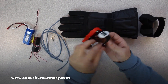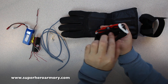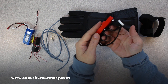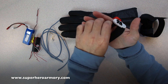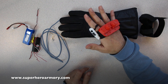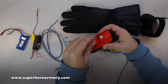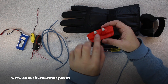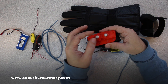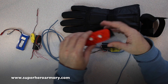Here's the hand module. I attached this webbing here and thinner webbing for the fingers. The way this goes on — this one goes over that finger — and then the thumb is used to hit the trigger switch. In the electrode assembly, I'm using nylon screws so I won't have any kind of conduction going through the thickness of the plate that could potentially zap me through the glove. The only metallic parts are the washers — I'll slip the wires underneath those and tighten them down.